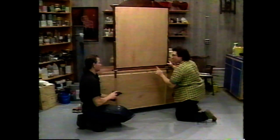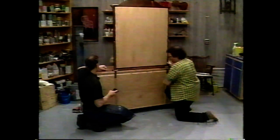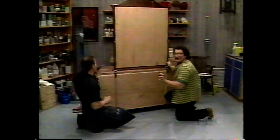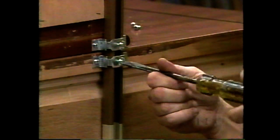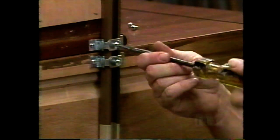And that makes it nice and tight. Yes. If you were doing this by yourself, you'd keep a knee against one of these brackets until you got your screw in the bottom. Okay, the last thing you do is with a regular slotted screwdriver, tighten these guys, and that keeps it from shimming around. That'll bite into the metal and into the wood. Yes, it will. It's your final clamp.